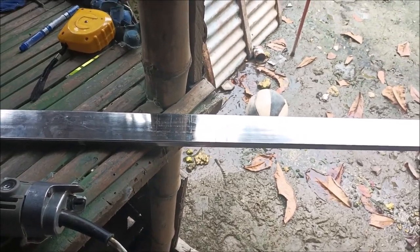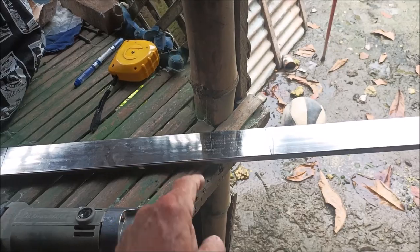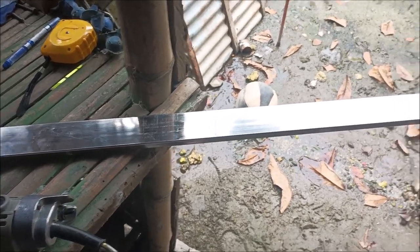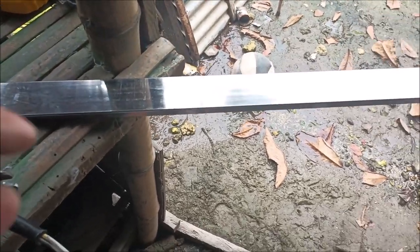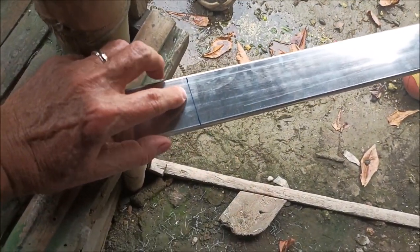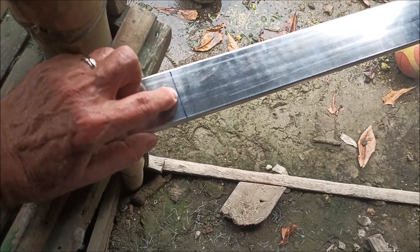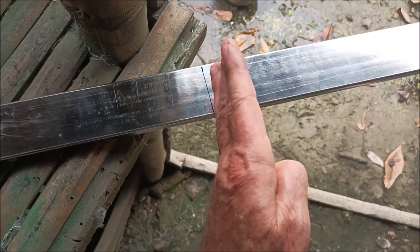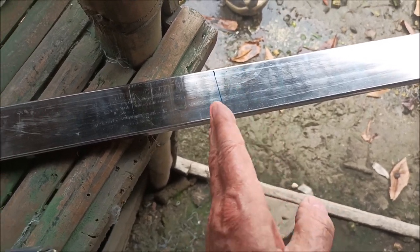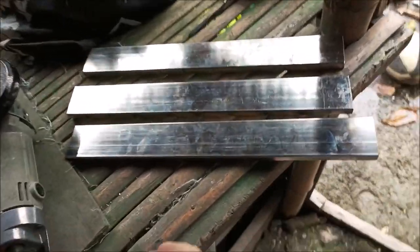I'm going to go to town cutting this — I can't hold the camera and the angle grinder and this piece of stainless at the same time, so I'm putting the camera down. As I said in my other video, the way you cut this is you just score it and slowly score it back and forth until you cut through. You don't start cutting deep with the blade all at once, because if you twist the blade slightly it'll shatter. All right everybody, we've got it all cut.